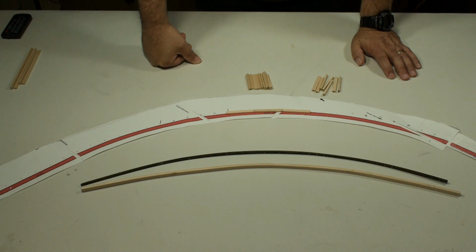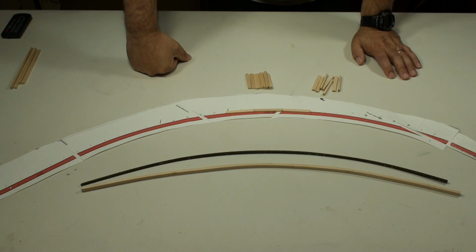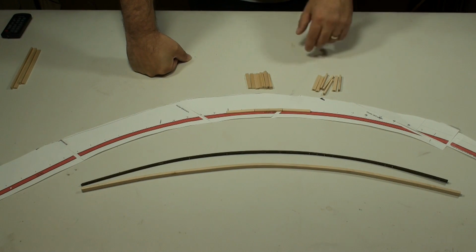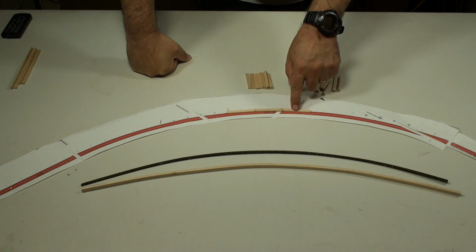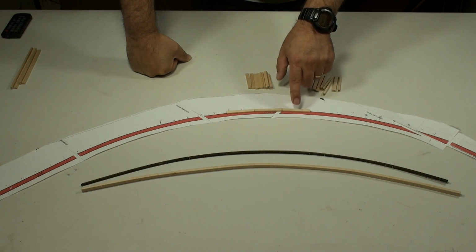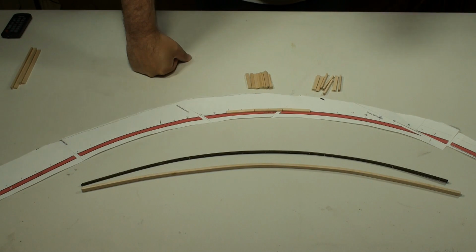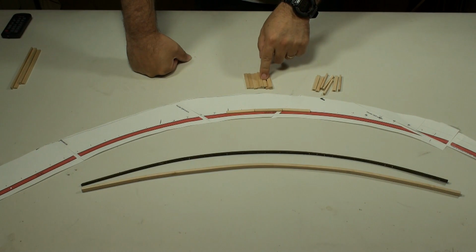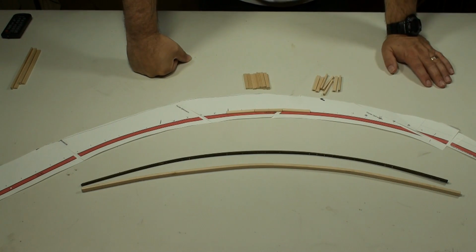I used a chopper to cut my angle pieces. That's a little bit more difficult, but you can do it. You don't have to bevel it too much. You could actually probably just sand off your one edge. These are typically right at 2 inches on the short end, and probably the outside ones are like 2 1/32 of an inch. The inside ones are right at 2 inches. So as you can see, that needs to be a little bit smaller, and so everything lines up.